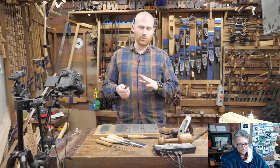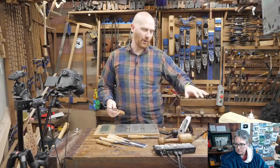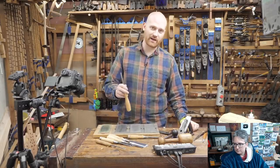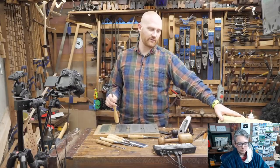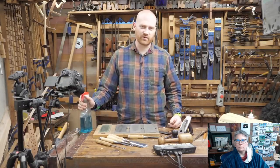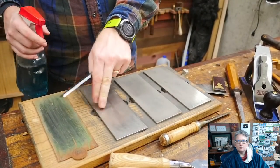For sharpening, I rarely let my chisels get dull. I usually end up taking them back to the stones — at least the fine and extra fine and then the strop. For my carving chisels, those never get dull enough to need a plate — they only touch the strop. Unless I drop them or bash up the tip, every five to ten minutes of use they hit the strop again and stay perfectly sharp. For my bench chisels I usually let them go a little bit more — I have to sharpen them every two to three mortises, though with the Richters it tends to be more than that.